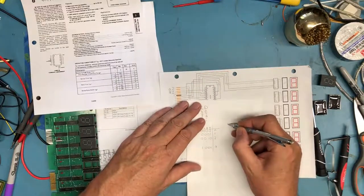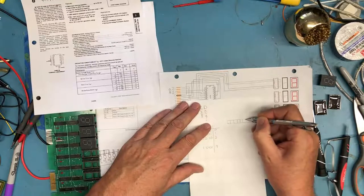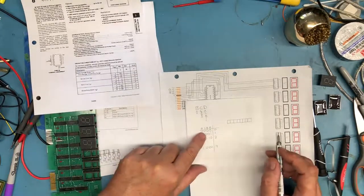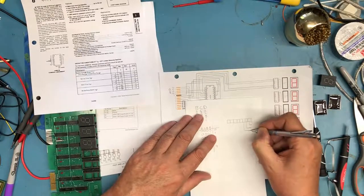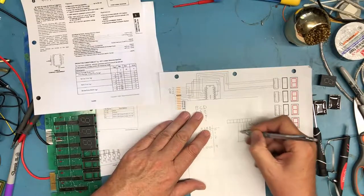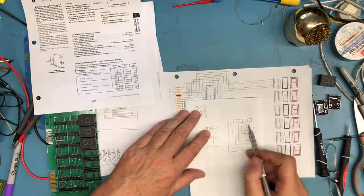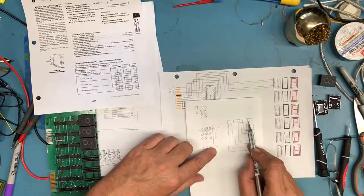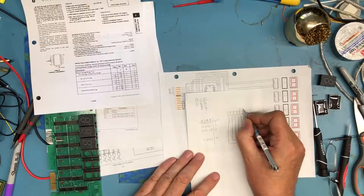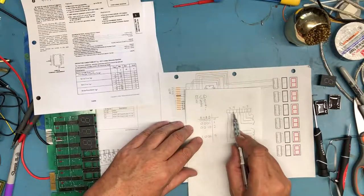And what this allows you to do is take, say, a single byte in the computer. So we'll draw a byte out here. One, two, three, four, five, six, seven, eight. So I've got a single byte of memory, and I'm going to say that's BCD encoded. What that means is these four bits here become one BCD set, and these four bits here become another BCD set. So we know this position in BCD can represent, with these four bits, the values from 0 to 9. We know the same thing is true for this group of four bits. So binary coded decimal is a way of basically having the value of 0 to 9 here, 0 to 9 here. If I had a binary coded value of 99, I would have 1001 here and 1001 here.